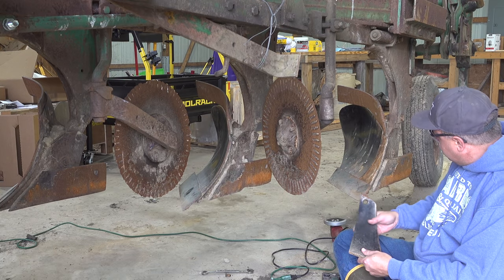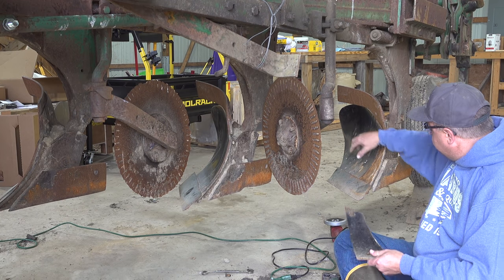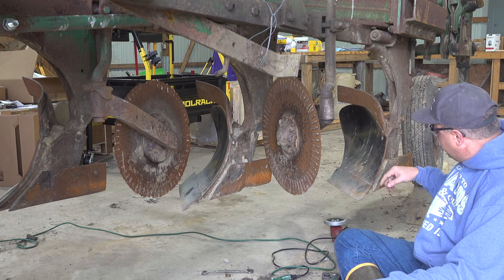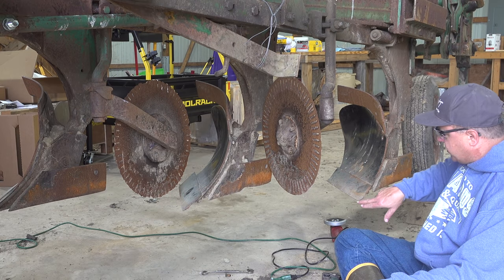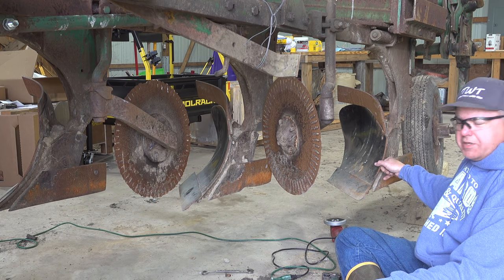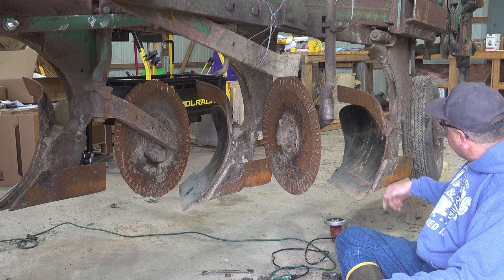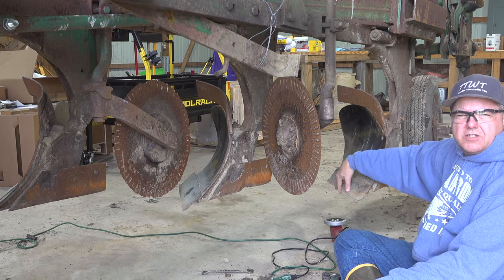I'm replacing these shins. This is called a plow share — in the country we call it a plow point. This is called the moldboard, and this is called a shin. All three of these pieces go together to make what might be called the plow moldboard. There are three pieces because they wear at different intervals. This tip wears out the soonest because it's the point of contact with the soil and has to be replaced quite frequently. The next most frequent piece is the shin — it's still pretty close to the soil and wears pretty bad. The most expensive part is the moldboard, and you don't want to replace that very often. So these other two pieces are meant to protect the moldboard. In this case, the old shin is worn really thin.